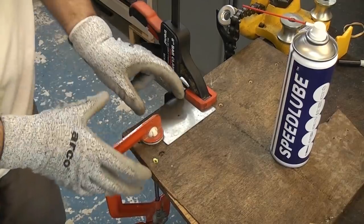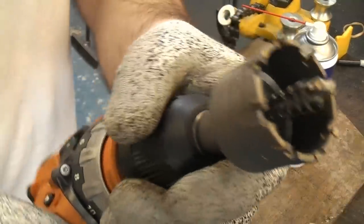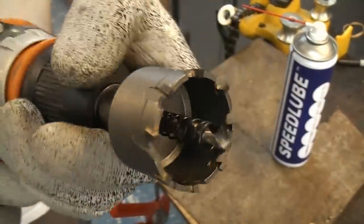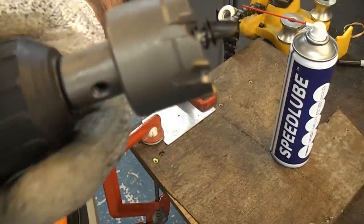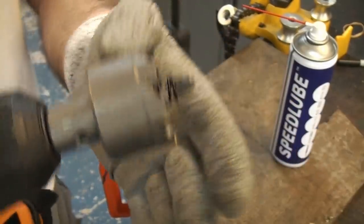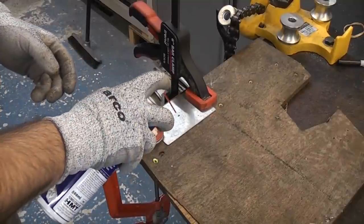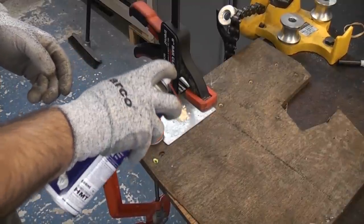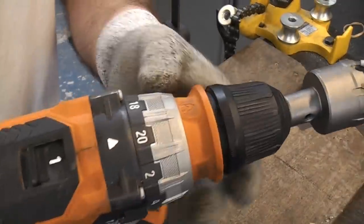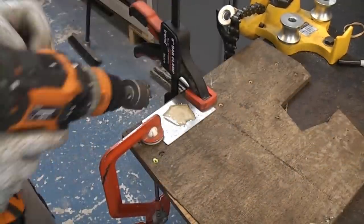I would normally use a pillar drill but it is a lot easier doing it like this. To do the cutting I'm using a 38mm tungsten carbide tipped hole saw - it's actually a cheap make I've just bought off eBay just to see if these are any good, because it was incredibly cheap for what it is. I'm going to start off by putting some lubricant or coolant on there, and I've got the drill in the slower speed with a torque setting of 20 just in case it does jam.